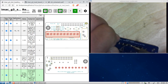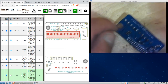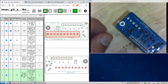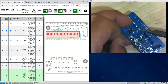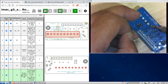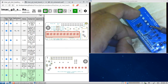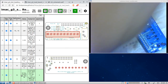Well, as you can see, I'm making a solder blob there. That is not a good solder joint. Seems like my iron is acting up again. Let's see. Okay, see if that helped. Alright, let's just wait while this heats up a little bit. As you can see, I'm just leaving it there, and when it reaches the right temperature, the solder will sort of form like a little pyramid. There we go, nice even pyramid. Okay, that's acceptable.